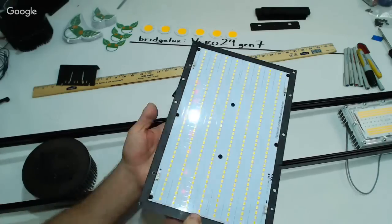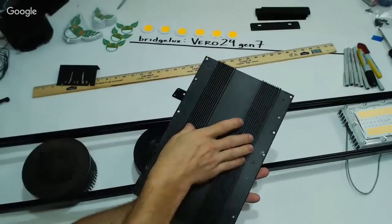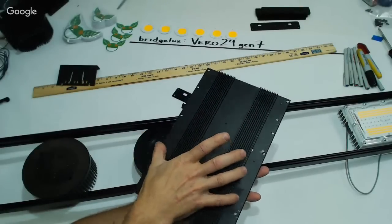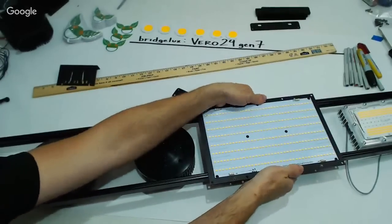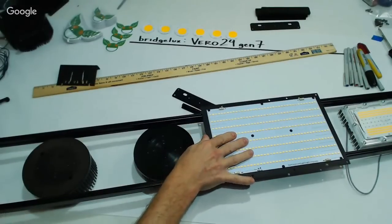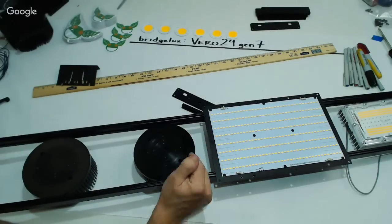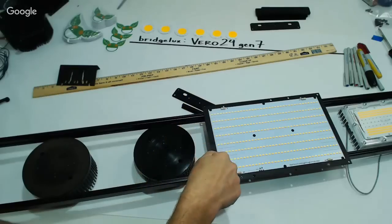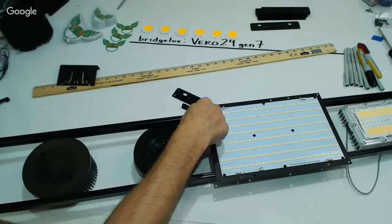But if you already have quantum boards and you have Slate 1 heat sinks, which are the less expensive ones, the ones in the $15 range, these extrusions fit exactly perfectly in between here. So there you go. That fits. It's actually a press fit. It's fairly snug. You would not have that sliding function with these, but you don't have to buy anything else. What you would have to do, though, is take a drill bit and drill 4 holes into your heat sink. There's plenty of room. And then you just run a screw. These have a little extrusion, so you don't have to tap or anything. You could probably just run a self-tapping screw, assuming you drilled there and there.